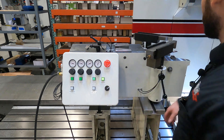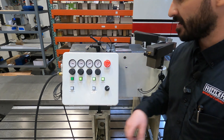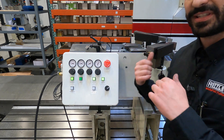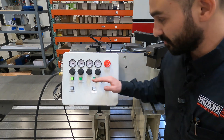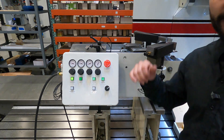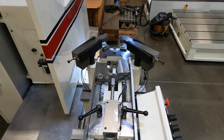It's as easy as working right to left. Press the first button, load the rod, clamp the rod, locate the left side of it, and engage the wedge on the back. You'll be able to see all that when I put the camera up top here. That's it — right to left clamps everything down and then you hit cycle start. I'll bring the camera up here.